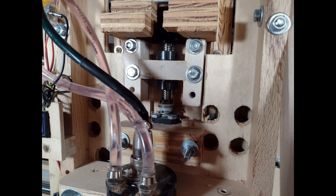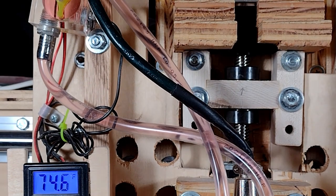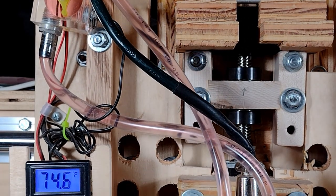The third thing I did was add a thrust bearing to my Z axis. I've been told by multiple people I trust that the stepper motor for the Z axis is not made to support that much weight. Now, in truth, I've had it this way seven years now and it's worked pretty darn good, so I'm not convinced that's an issue — but the whole reason for this video is to explore ways to make my machine more rigid. I added two collars to my threaded rod with two thrust bearings inside, and between that is an H bracket attached to my X carriage. Here is the new thrust bearing in action — it's a little easier to visualize when you can see it running. First I'm running slow, and then we'll go fast up and down a few times.